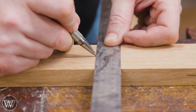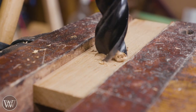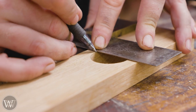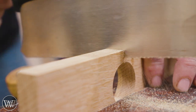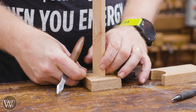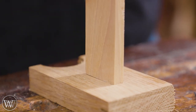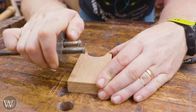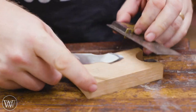At this point, they're done — they're winding sticks. I don't need to do anything more; everything else is just aesthetics, just for fun. But I'm going to be making a couple of the wooden feet that are kind of like Roubo's. I'm going to drill a hole right in the middle of this scrap block, which will become the bottom of each one, giving me that half-round on either side. Then I'll put the winding stick onto the block and mark out exactly how wide it is, and set my marking gauge to those marks so the measurements are reality rather than guesswork.